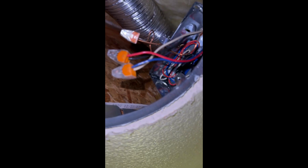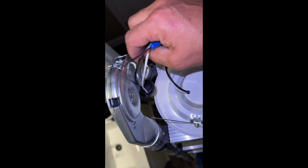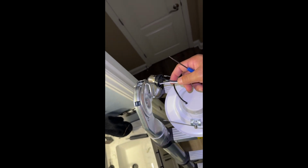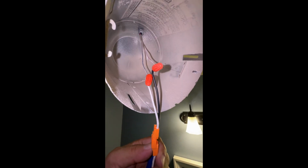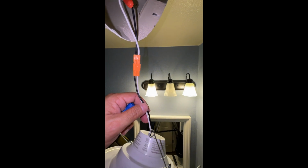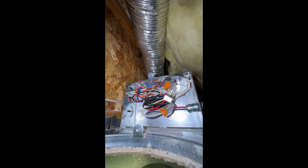So everything got taped. These 2 wires went into the clips, and now I'm going to cut these 2 wires, tie them up to that, and we should have a light. The reason I did this clip and just cut the top off was so that if this light ever goes out, I don't have to move any of that. I'll just take the clip off, change the clip, and then we'll be good, so people won't have to get back in there. So again, all my wires are now tucked in. I'm going to cover things and get everything sealed back up.